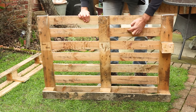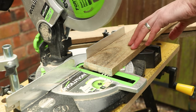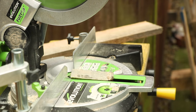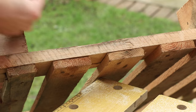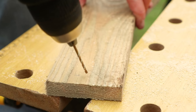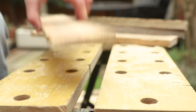Now count the number of planks that run up the pallet — in this case we have seven. Then using scrap pallet wood, cut twice the number of planks to the depth you'd like your log store. So in my case I have 14 planks each to the depth of 50cm. Next we need to attach these pieces of wood to the pallet, so take some measurements to make some pilot holes on the wood, then briefly leave these planks aside.